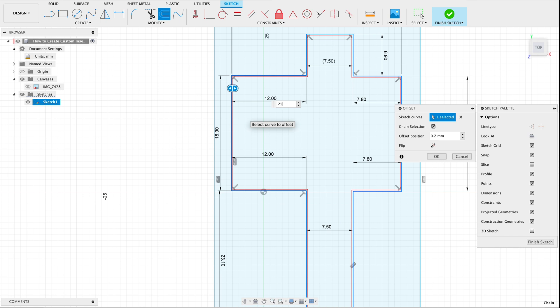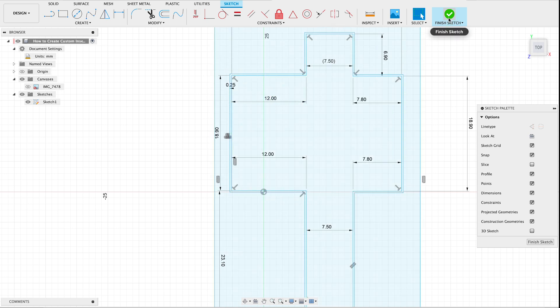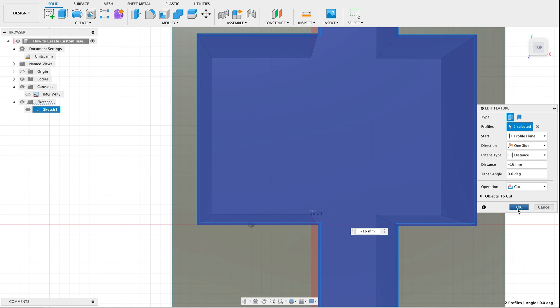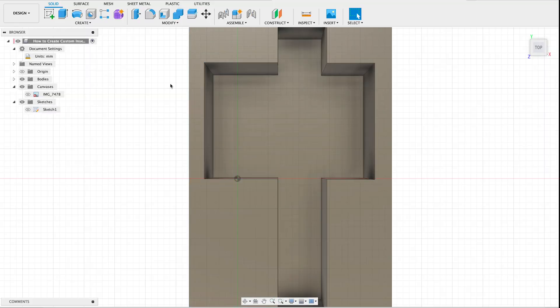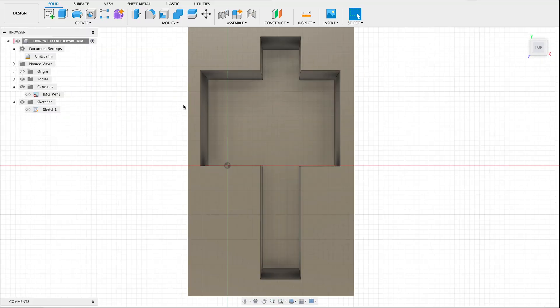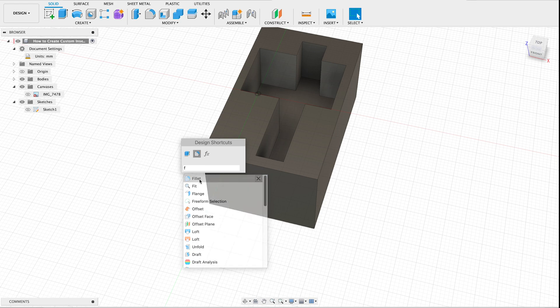To offset for 3D printing inaccuracies, I'll offset the sketch by 0.25 mm to make it slightly larger so the nozzle can fit inside. Now we've offset by 0.25 mm within our sketch, giving a little extra room. I'll go ahead and cut the shape — our design is now completely mapped out and symmetrical, giving enough leeway for the nozzle to fit inside the accessory. I'll add a little detail to the print, then send it off to the slicer.